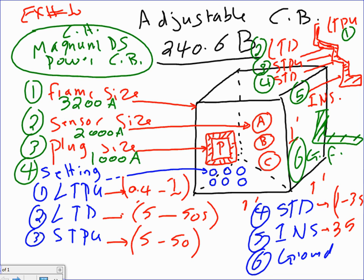If you are to work for an engineering firm or on high profile jobs and you don't understand these, you get very confused. We were just talking about, guys, Mashad and how they have their own standards, that if you have this switchgear, you can use this circuit breaker, but they don't tell you in the standards that there are adjustable circuit breakers where I can use a 3200 amp circuit breaker and make it a 1000 amp circuit breaker without changing anything other than a couple of plugs in the circuit breaker. Unreal. So adjustable circuit breakers, guys, give you the ability to grow with the load.